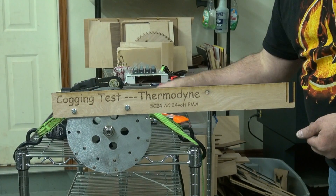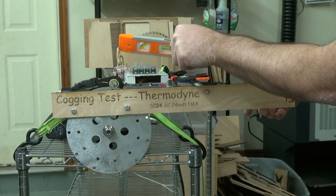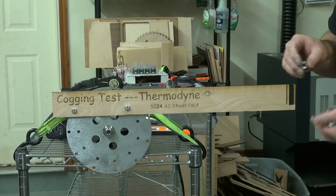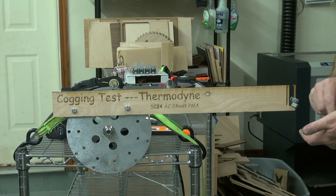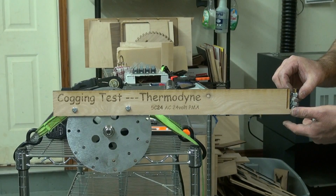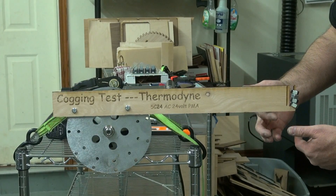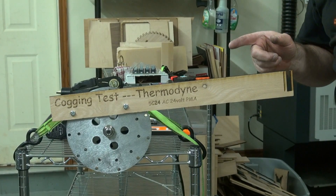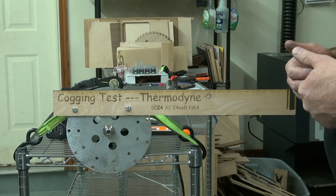So I think what we're showing is — we're dead center. I'm going to bump it a little bit, let it fall back down to its hardened spot, we're on level. One, two, three — looks like four is the magic number. With four nuts on there I can't even get it to stay. So it wants to spin. What that tells me is that the startup speeds for this Thermodyne PMA would be lower than they would be on the Renegade.